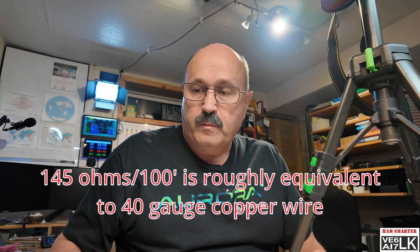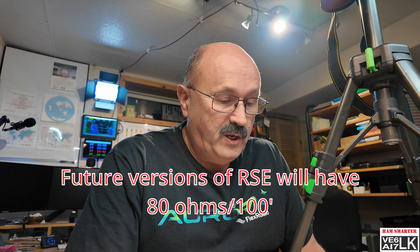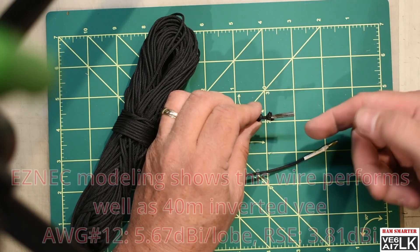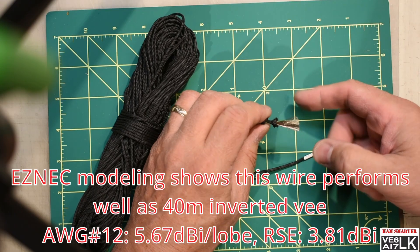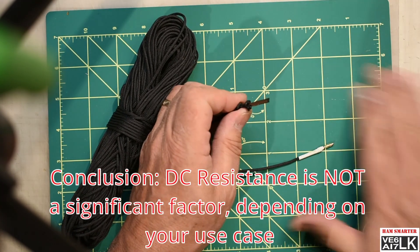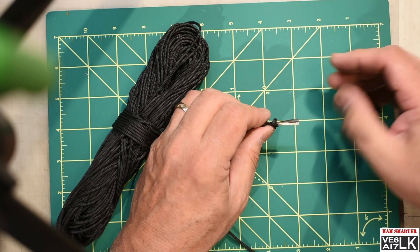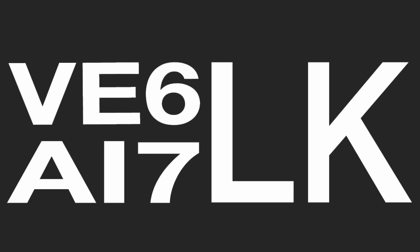Now I've got a connector on here that is nice and neat and tidy, and I can do something with this wire. This wire has some resistance to it — the measured resistance is about 145 ohms per 100 feet, so that's a lot. This is not a video to speculate on what you can use this for; it's a video to show you how you can solder with it. As you can see in the overhead shot, this is what it looks like when it's all splayed out. I have no idea how many strands there are — there's a lot, and they're really, really fine, like finer than a human hair. You'll want to clean up and vacuum your workspace after working with this stuff so you don't have any carbon fibers floating around in your workshop environment. Anyway, that's all — just a fast way to solder this stuff up. Hope you've enjoyed. 73, we'll see you next time.